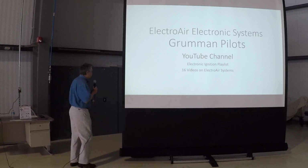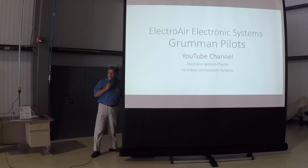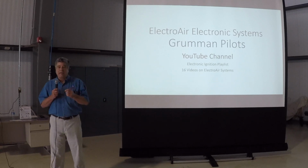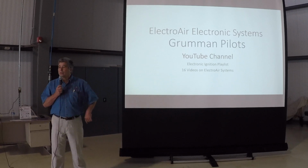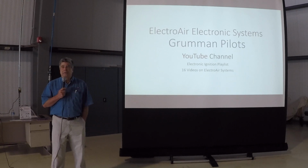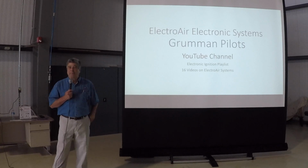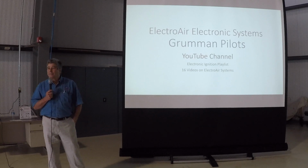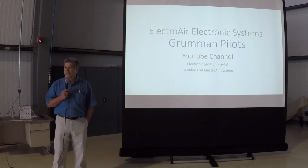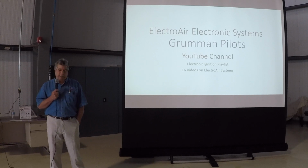Because if you read the literature, and I always recommend that everybody read the instruction manual, because it does call out a couple of important things, and one is it calls out not using normal massive electrode plugs on the electronic ignition. So when we were installing our first one, we read that, but we didn't buy any of the high-energy plugs. So we just grabbed 4 scrap spark plugs, threw them in the cylinder, started the airplane, it ran great on the mag, and we went to electronic, it died.